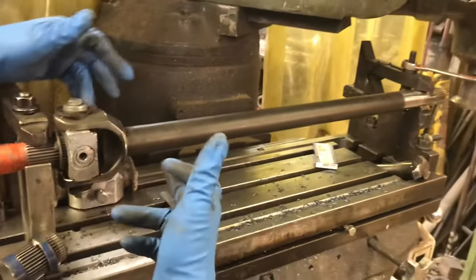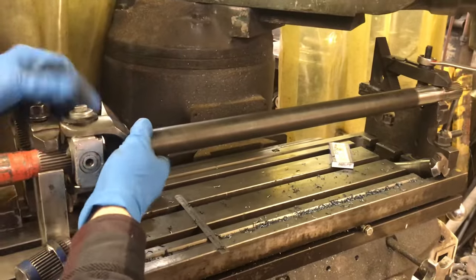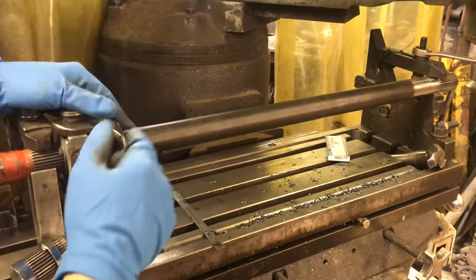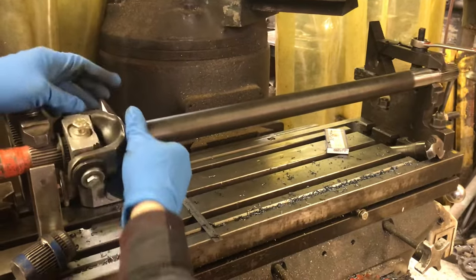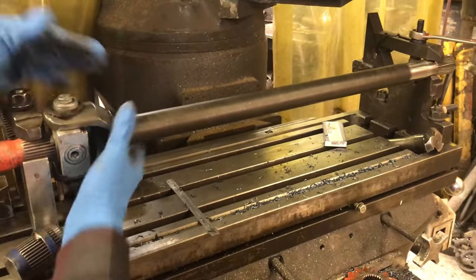When I'm figuring out the size, I put a cut on each side and measure it with pins. I'll put one straight up and go around 180 — now I know I'm straight up. If you're doing an indexing head, you've got to crank that thing for an hour to get around, and you've always got a chance of miss-cranking it. With this, even if you cut a spline in the wrong place, you can come back and get it in the right place.